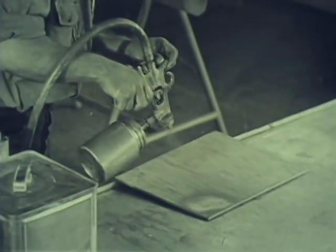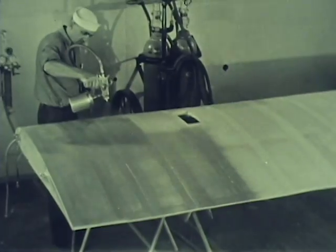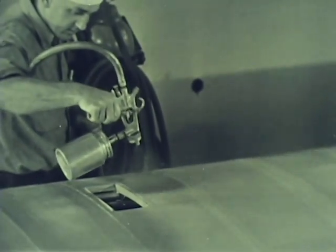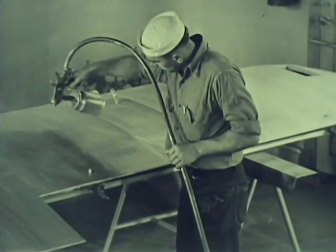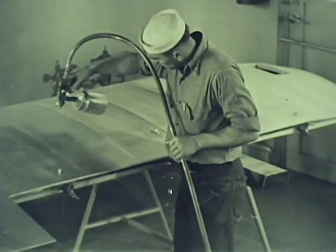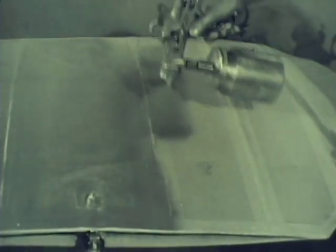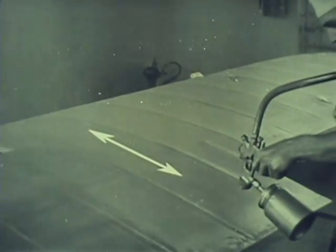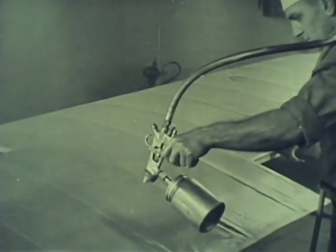The spray gun should be adjusted so that it throws a full spray about 12 inches wide when held about 8 inches from the surface to be sprayed. After the gun is adjusted, it can be held about 6 to 8 inches from the surface depending on the results obtained. When spraying, the hose line should be held in one hand with enough slack so that the stroke will not be interrupted. The gun must be in motion when dope is being sprayed. To prevent laps from showing, each stroke is overlapped on the previous stroke about 2 inches. Cross spraying produces a smoother, more even finish. The first spray coat can be applied crosswise on the surface, and the next coat should be applied lengthwise or at right angles to the preceding coat. All spray coats should be applied in this manner.